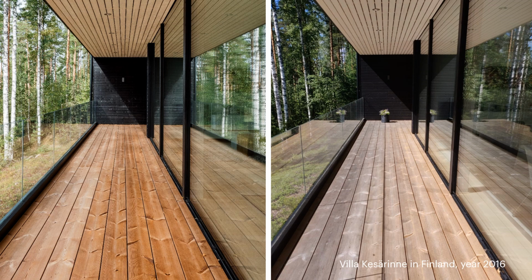The decking is recommended to be treated immediately after installation so that the surface is protected from moisture and dirt, and no separate cleaning is required before the treatment. The maintenance treatment should be done every 2 years or more often depending on the climate conditions and the use of the terrace.